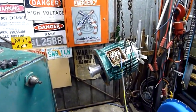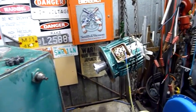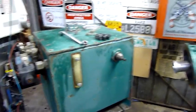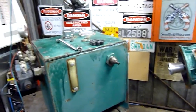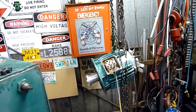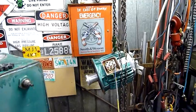Anyway, it works. The idler motor's quite happy. I wonder if I should turn this into a generator. I'm quite happy that that's one single piece, so I should probably just stick with the plan and go for a small hydraulic power unit. But a small three-phase generator would be handy — it's just a matter of syncing up the frequency, that's all.